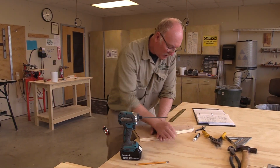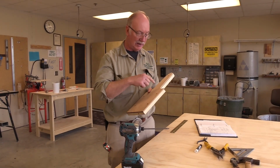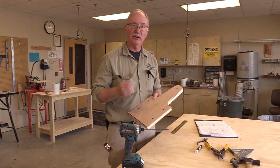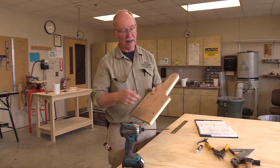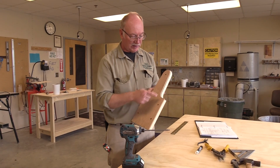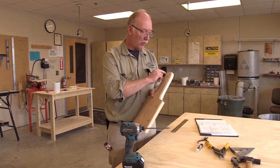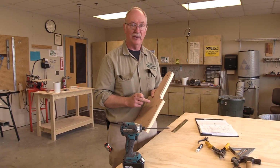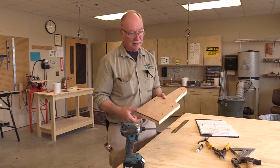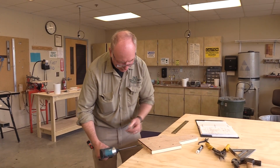I wanted to also say something about pattern degradation. When you have a CNC, which uses all numbers to program a shape like this, the program doesn't degrade. Every time it cuts, it's cutting the same exact profile. All I have to do is change out cutters and stuff. But this pattern will degrade. Over time, the bearing rubbing on this surface and different things, it'll wear out slowly, but it will wear out. So when I recreate this, it may not be the same, but it's just part of aging, I guess. We all degrade in some way, but the patterns will degrade.